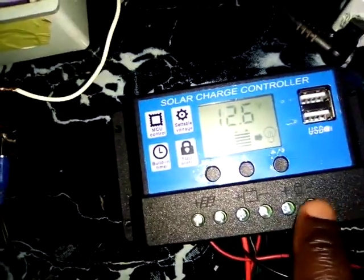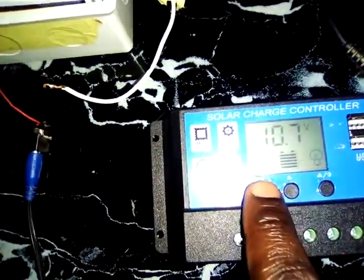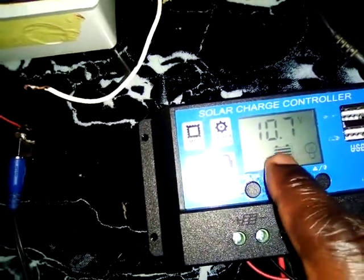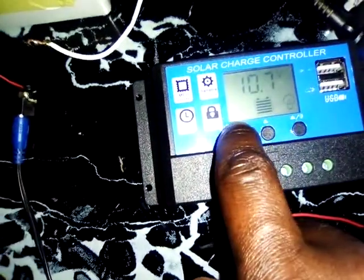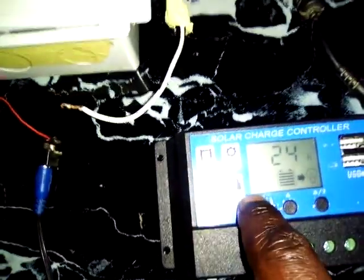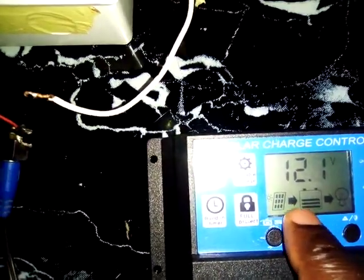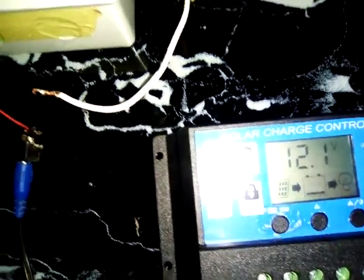Pressing the button again cycles through other parameters. It's telling me it's giving out 12 volts to the lighting output point — the arrow points to that lighting terminal. Pressing again shows 10.7 volts: this is the auto cut-off threshold — once the battery voltage drops below that level it will cut off power to the load. Pressing again shows 24 volts, which is my solar panel voltage. The display also shows the battery status and the current stage, indicating it is charging — the solar panel indicator light confirms the panel is connected and charging is active. Thank you very much.